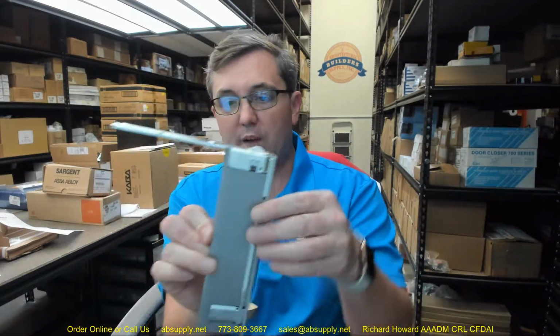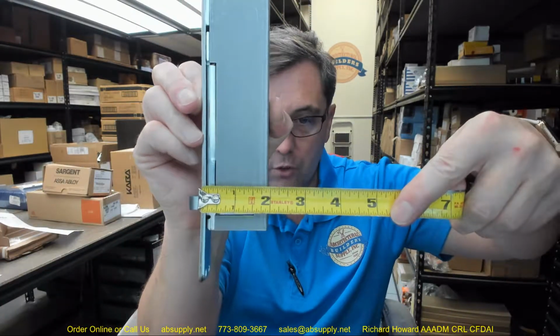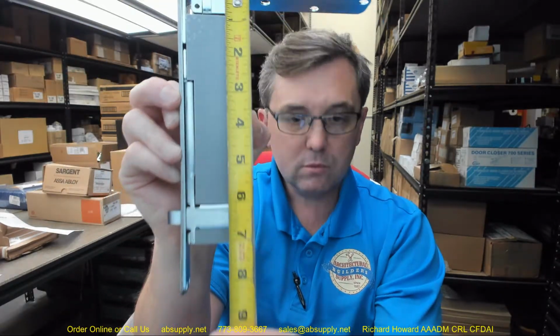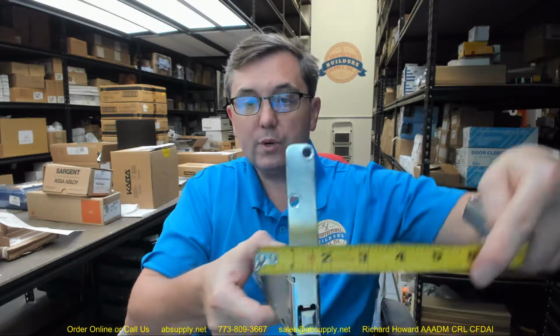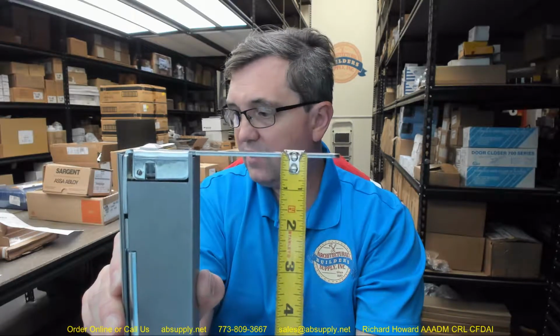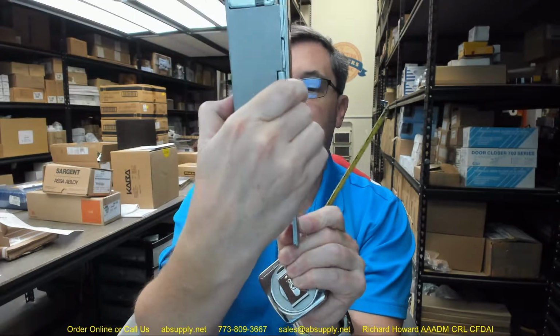So we've got the faceplate dimension. I've just said to you that the depth is 2 inch by basically 7 1/4. 2 inch mortise depth. You're good with that. Mortise height, 7 9/32. Sure, 7 1/4 I said. Okay, a little bit heavy on that. Then all you're going to need to do is prep that 1 inch width, the thickness of that plate, which they've got at 1/8 of an inch, also 1/8 of an inch. This is going to be a little bit heavy on 1/8 of an inch.